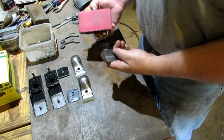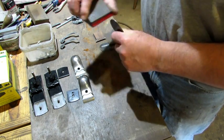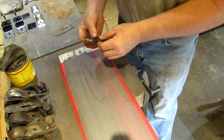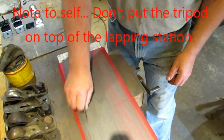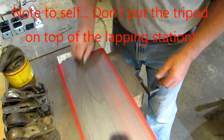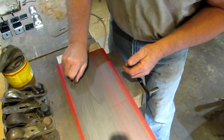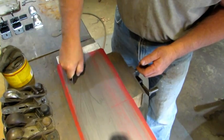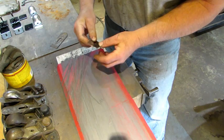After I clean the grooves out, I take another sanding block with 150-grit paper and clean up the rounded edge right here. With both top edges done, it's on to my lapping station to do the flat edges. It only takes a few passes back and forth holding it at 90 degrees. Take a look — a little more on the front and back to do, so just add some pressure to the front and back. Get it up onto that curve just a little bit. Both irons are done and the edges are cleaned up.